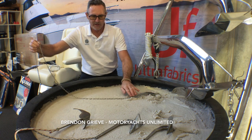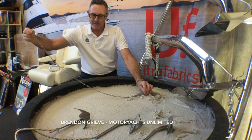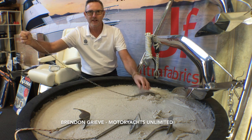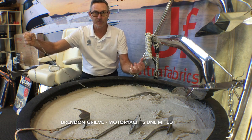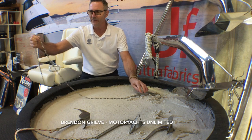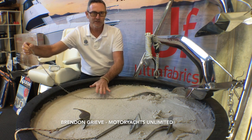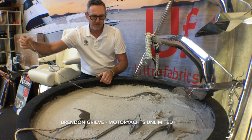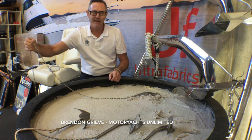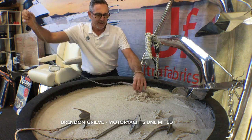If you find that your boat is jarring when it's at anchor, what's happening is the chain or the line is pulling tight and it's pulling straight from the anchor — and that's when the ice falls out of your drink or you stumble over. So if you're anchored and that's happening, you don't have enough line out and you're pulling straight for the anchor. You should have enough line out, or the chain should be heavy enough, so that all you're doing is just gently raising the chain and the boat will pull back again. You shouldn't be pulling directly from the anchor — that's when you start doing some damage or you pull the anchor out of the dirt and it starts dragging.